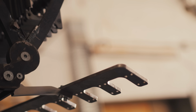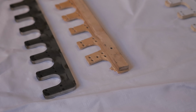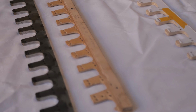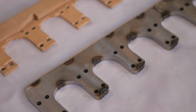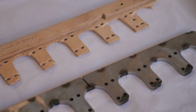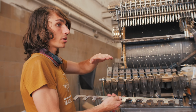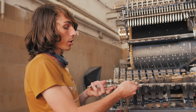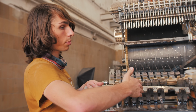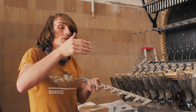This is the old version of the rack, which Martin designed more than a year ago at this point. There's angles so that the droppers would end up facing the audience, but the rack itself would match the angle of the vibraphone. But what ended up happening is, since the droppers have to be mounted at an angle, we ended up having a compound angle, which meant that all the droppers were slanted also this way. They would send the marbles not straight down.